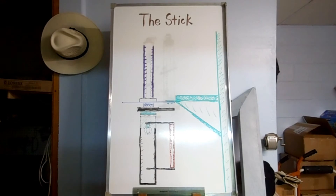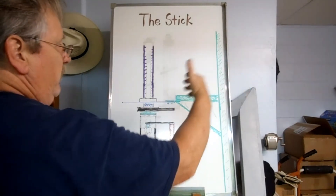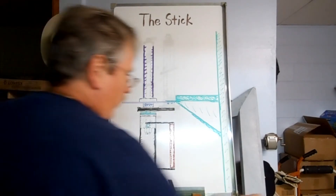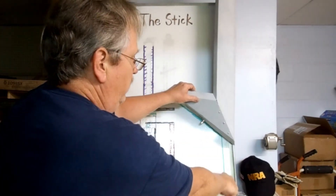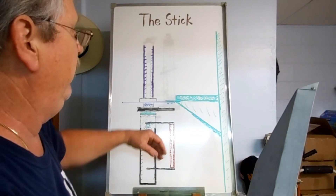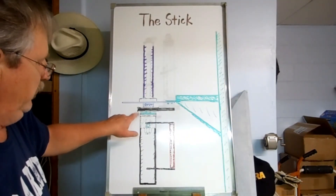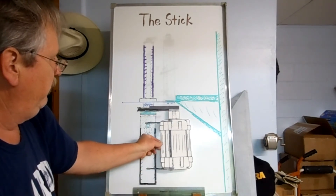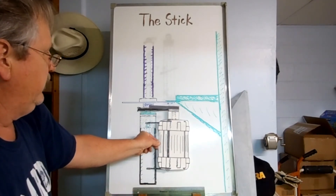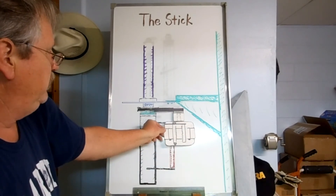Here's another drawing showing a little more detail. The top of the drawing is cut off because it's actual size. The plate that the blades mount to is going to be slightly bigger, which makes the turbine wider. The blade is going to come down another foot, which will put the generator more in the middle of the turbine rather than directly underneath it. There's a four-inch pulley on the turbine, and whatever generator you attach will have a two-inch pulley. This shows the Freedom 2 on a stick, the Freedom PMG on a stick, or the Wind Blue / any other alternator-style PMA on a stick.